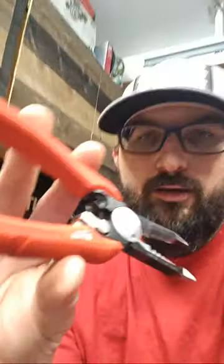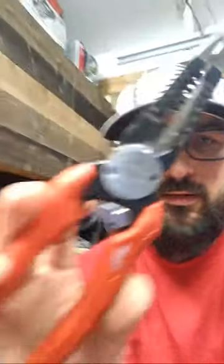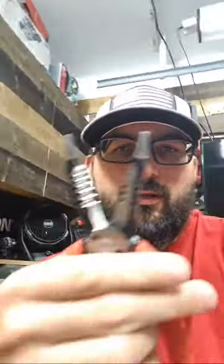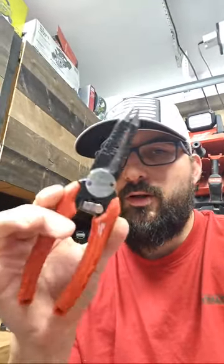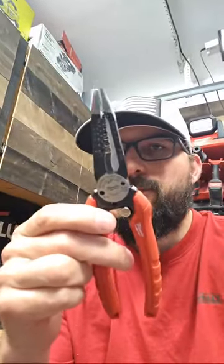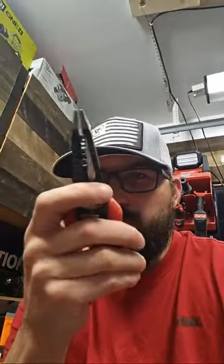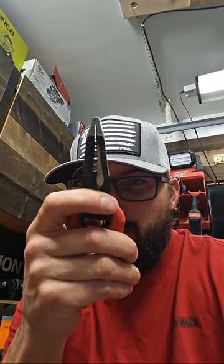Something I just tried on these: I busted off the overhangs where you can flip these down. I've occasionally used these and they get stuck in the closed position, and I think that'll help that. These Milwaukee needle-nose-style strippers are kind of perfect in every way — I was really wrong about the first Milwaukees I tried. These are the 7-in-1s or 11-in-1s, the model 48-22-3079s. The other ones that have the flat bill up here, kind of like the Knipex, are not as good.